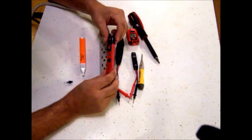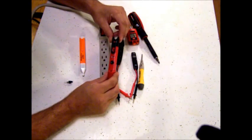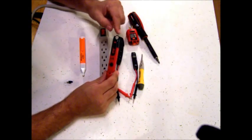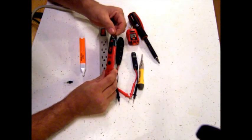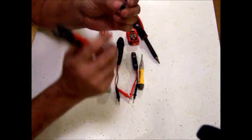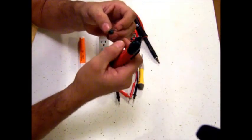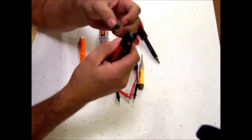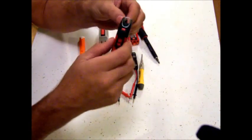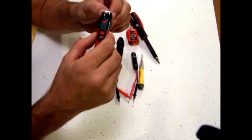This first tester is basically a holiday light tester, for the little lights you put on your Christmas trees. On this end there's a hoop with a little metal blade. If you look at these light bulbs, there's a little ring around the top before the glass. If you start pulling on the glass, you'll pull a lot of them out. So to get the bulbs out of their sockets, you simply put this down over top, hook it, and work it into that little groove and pick the light bulb out.